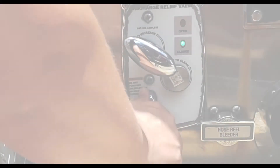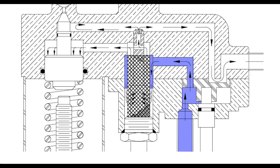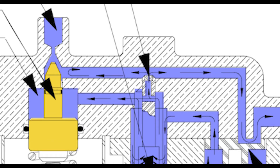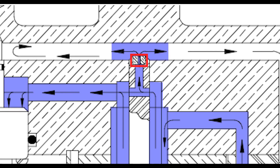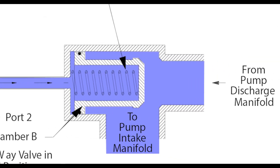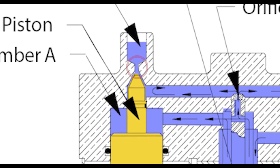When the switch is turned to the on position, the four-way valve reroutes water through the pilot valve. It flows through the strainer and then through the two holes on the stem. Water is channeled to the back side of the needle valve where the pressure causes the needle valve to open and close. The small orifice in the tip of the stem routes water to port two, which leads to two places: first, it pressurizes the chamber on the back side of the relief valve, which controls whether the relief valve opens or stays closed. It also leads to a small discharge port that maintains the pressure inside the pilot valve.